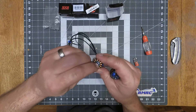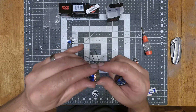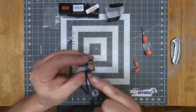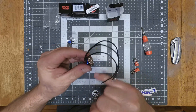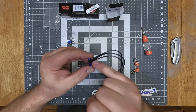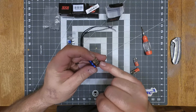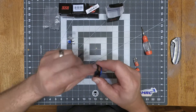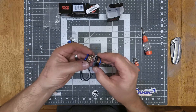They're tight in there — it's not going to spin or anything, it's definitely friction fit. The windings look way better on this one. They actually come out through on the bottom side instead of up on the top, and I wound them the right way. This one comes through on the top but comes down right away. The shaft must just have a burr on it — that's why I pulled that bearing out.